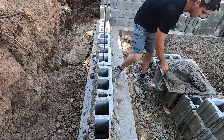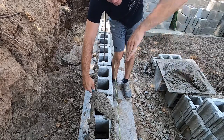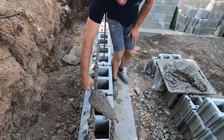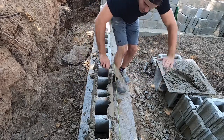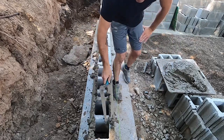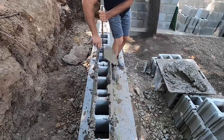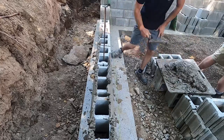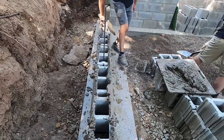Now the other way, it's a little harder, more definitely with your fingers. So the same thing, you're pointing like a 45 degree angle away from the wall, like that way. Nose, twist, again, 45 this way too, down and slide at the same time. Down and this way in one motion. You can go either way with it. When you get good enough, you can spread both ways on the wall. But it's always easier when you're first starting to go backwards like that.